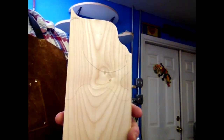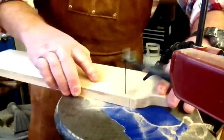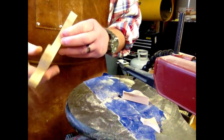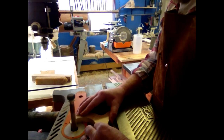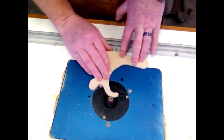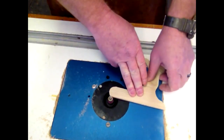I've got just a real simple little pattern. This is where the plate or bowl will sit. So let's get it cut out. We'll take them over to the sander and get them sanded up. Now here I've got a quarter-inch roundover bit — going to round over all the outside and inside edges on both pieces.